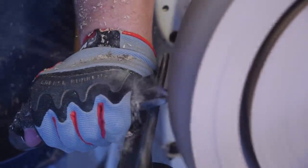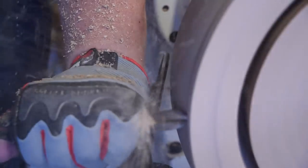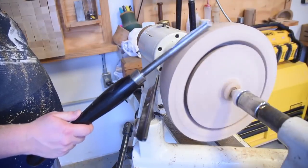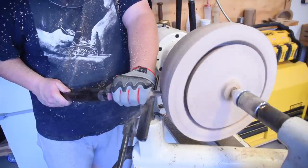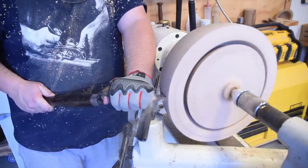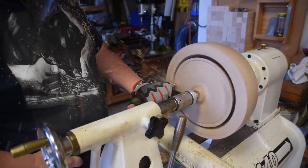And right now I push to a push cut. The pull cut works off of the wing, the push cut works off the tip. And it was getting dull right here. You can see I'm getting shavings. That right there is also a trick I use to determine if there's any flat spots, which means I don't have it running true yet. Notice right now all the dust that's coming off, that tool is dull. Right here, I went and sharpened it before I went to the next step.